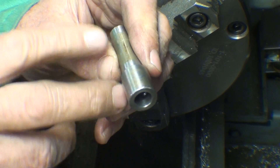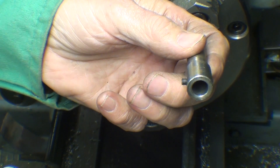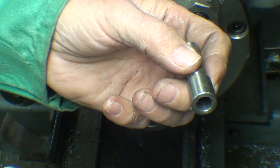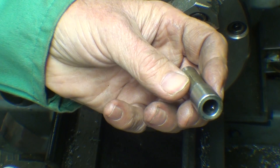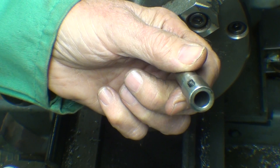The hole is two inches deep. And since it's going to be reamed three-eighths, I'm going to go a little undersized, and I'm even going to allow a few thousandths to bore it before I ream it, and that assures concentricity.